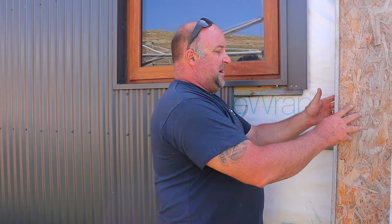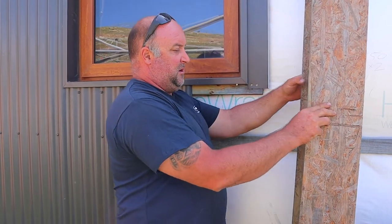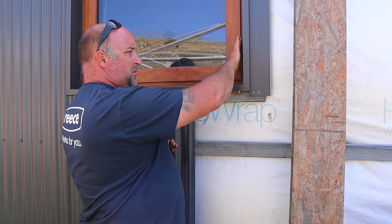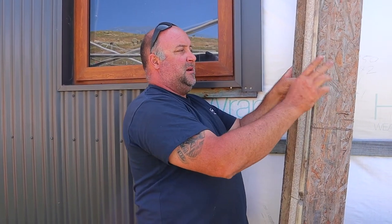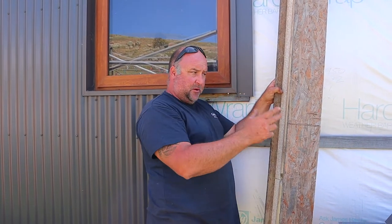So, our house is made out of SIPS panels. This is just an off-cut. These are 145mm thick. And basically, that is how the whole opening would have been left. And then we would have put a 120mm timber — 120x35 — in this slot here. And that would frame out for the window, door, or whatever, any sort of opening.